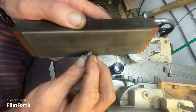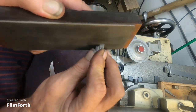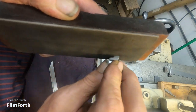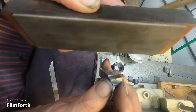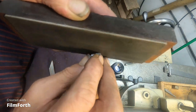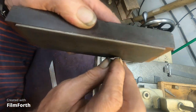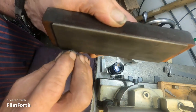I take all the burnt-looking stuff off — I don't need to regrind the top, I knocked it back from the front. See that burnt stuff coming off? Let's do it to the other one. See that dark area right on the tip? We're going to take that off first. There might be something hiding under that. This is really good carbide — this stuff will wear rather than chip. With a lesser quality tool, it would shear the tip off and you'd have to grind it back like 30 thousandths instead of 10.